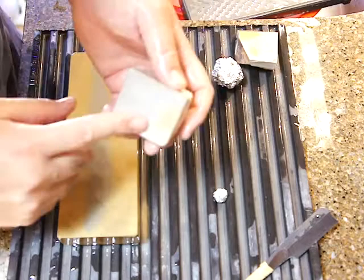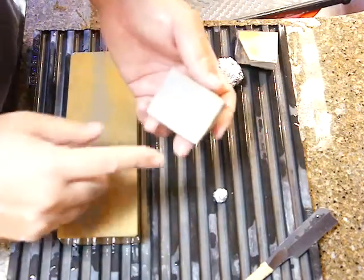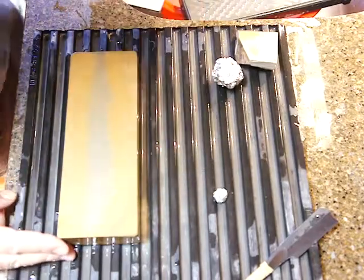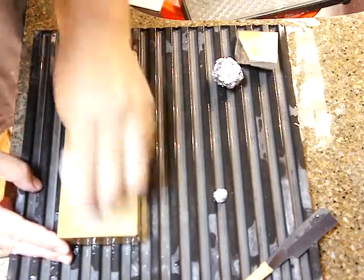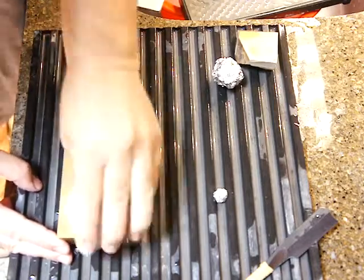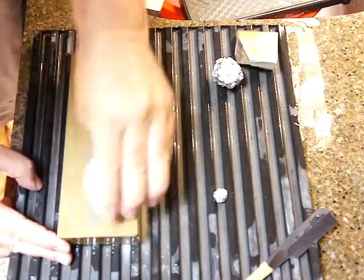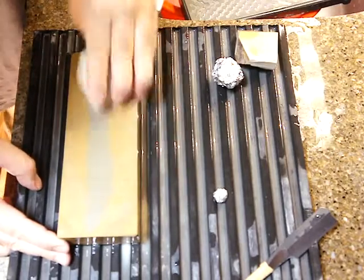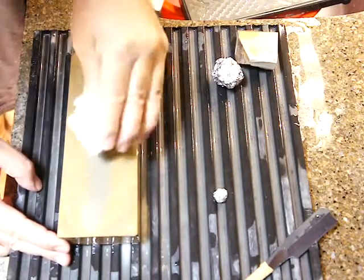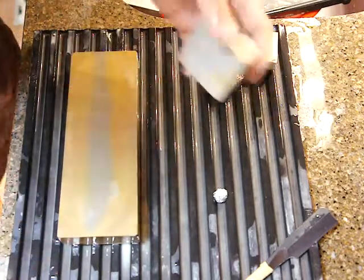If the Koma lapping surface is too smooth, we can scratch it a little bit with a nail, and that sometimes makes it easier to lap the whetstone. We don't need too much water, just a little amount of water, and the slurry from the Koma should at least come out a little bit milky in color. Okay, maybe that should be enough.